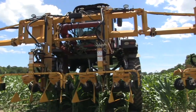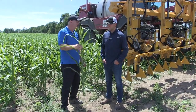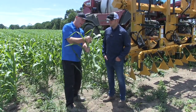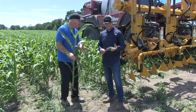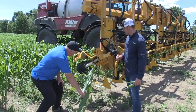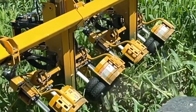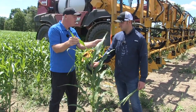Let's take a look at the nuts and bolts of the machine. This is the plant that's going to produce seed — this would be the female inbred. We don't want its pollen involved in the operation; we only want the pollen from the male plant, so we've got to pull that tassel out of there. In your machine, these rubber wheels do that for you — the tassel gets caught up between those rubber wheels and out it comes. Ideally we like to leave as many leaves on the plant as possible to aid yield, so you're trying to get it just at the spot where you can pull the tassel out without taking out too much of the plant.